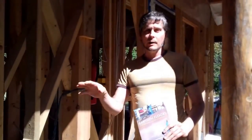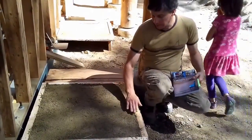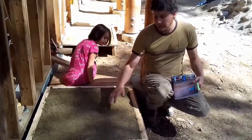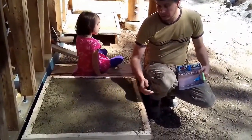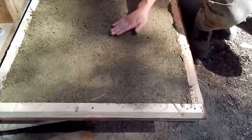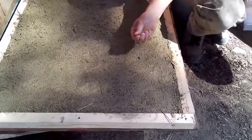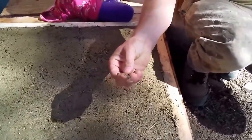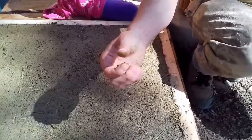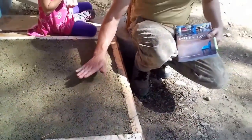We're going to look at one more sample we did yesterday. This last test batch is three sand to one native clay with a half bucket of chopped straw — so proportionally a half straw. It's still wet so we don't know what's going to happen, but my suspicion is we're going to get the least cracking. The concern now is whether the mix is starting to have too much grit and will become crumbly when it dries. When it becomes dusty and crumbly, that's when you want to scale back the sand — you've probably found the optimal mix.